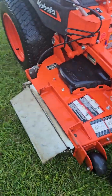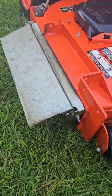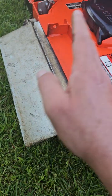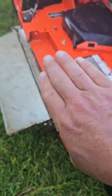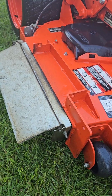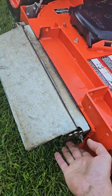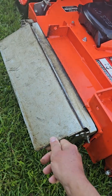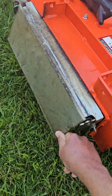The reason I keep having so many problems is because when you are cutting — it doesn't matter if the grass flap is open or closed — this plate sticks out right here, and it doesn't go all the way vertical, so it's hanging down to catch on something. If you're down in a ditch on an angle or you get too close to something, for me it's always because I'm cutting inclines and this might get close to the ground. Any pressure on this bends it, and once it bends, this little ear mount right here bends as well. It knocks this whole plate out of alignment, which means the chute blocker is rubbing on it really hard and no longer opens and closes the way it should.